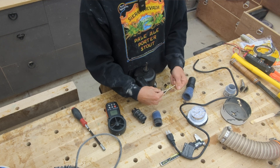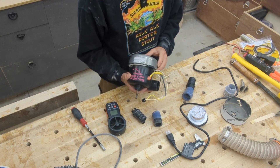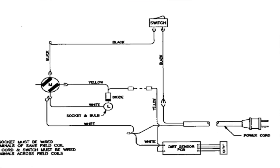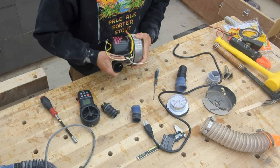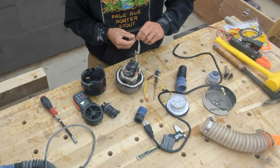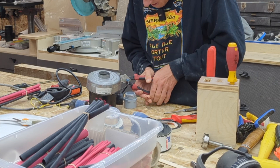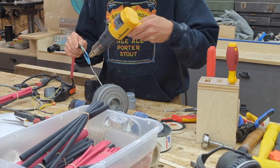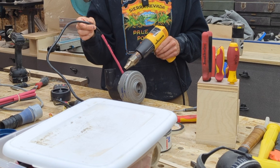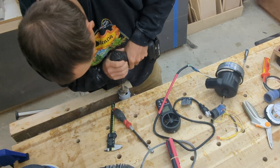Really, the three big things you need to do are: get it wired up, figure out how to attach your intake and exhaust hoses, and figure out how to mount it on the wall. For the wiring, I managed to find an old wiring diagram for this motor assembly. The wires I really need to worry about are the white and black — hot and neutral, pretty common with AC wiring. The other wires were for a floor brush and maybe a light, so I just popped the cover and pulled those out. I'm not wiring in a switch because I'm using the automated vacuum on/off switch, but if you're plugging straight into a wall, you'll want a switch.